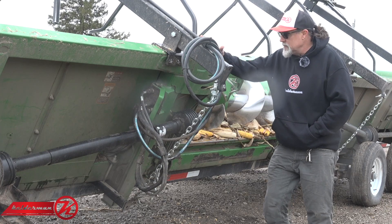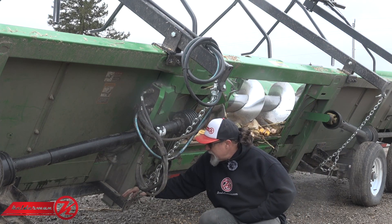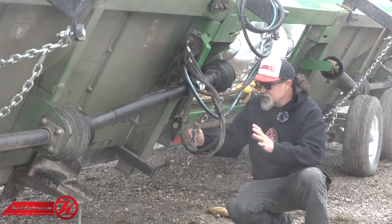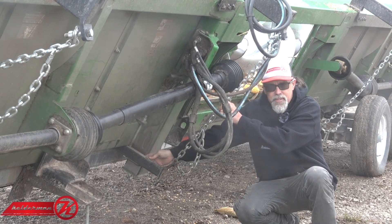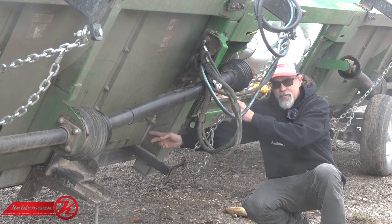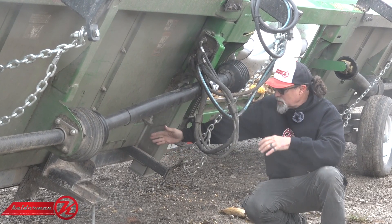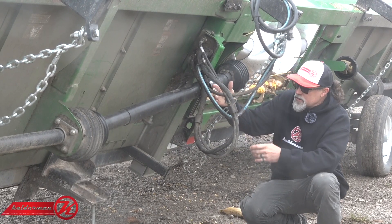The chain hangers on the center mounts go around this tube, so you just run this thing straight out and clamp it here with these five-eighths bolts. On the center chain hangers, the chain hanger is welded to a two by two piece of tube and has five-eighths bolts. These go around the square tube down here and just clamp — run them straight out. Just watch where they are in relation to this PTO shaft.